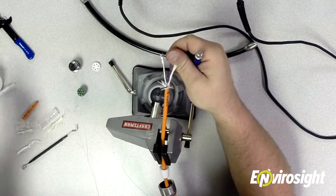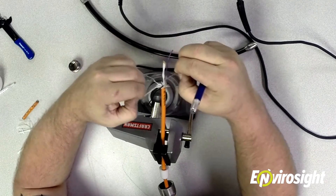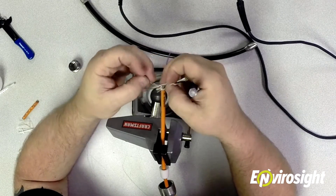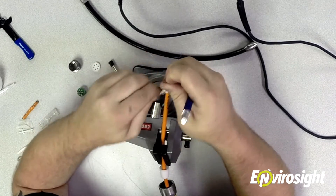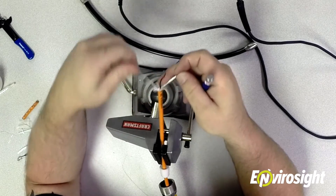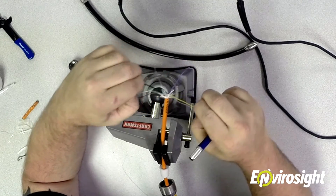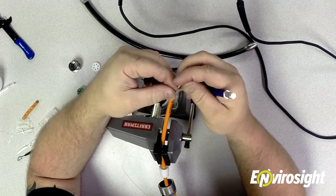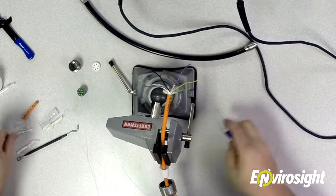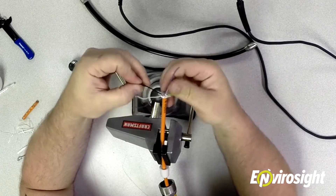The purple and black wires are both your power wires — that's why they're larger diameter. There's another bundle: grab the white and brown wire and pull it sideways to shrink back the Teflon wrap around it. You'll expose two clear filler wires — once separated, cut them off, leaving about a quarter inch to be embedded in the epoxy. White and brown are both your CAN communication wires. Do the same with the other bundle — green and yellow — which are your video wires. Pull them, then cut off the filler at about a quarter inch. At this stage all six wires are exposed. If done correctly, there won't be any damage to the jacketing, and you're ready for the next stage.